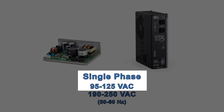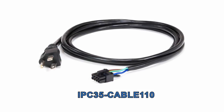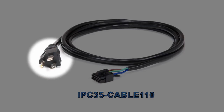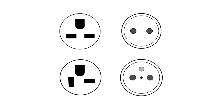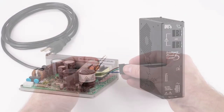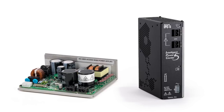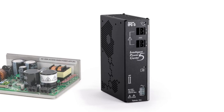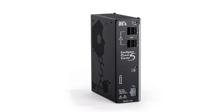For people who want to run off the lower AC voltage range — common when you're first experimenting with a motor at your desk or bench — we offer a pre-wired AC line cable. This cable has an 8-pin Molex Minifit Junior connector on one end and a standard US 120-volt 3-prong AC plug on the other. If you want to run off the higher line voltage, you can cut off the 3-prong connector and rewire it to your desired high-voltage connector, but you must remove or cut the jumper wire in the Molex connector or you will damage the power supply. When developing your machine, we recommend using the fully enclosed supply for maximum power and safety.